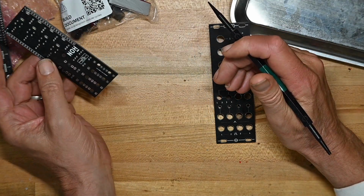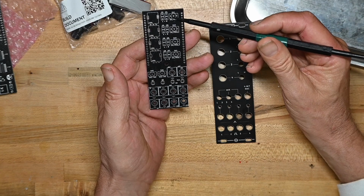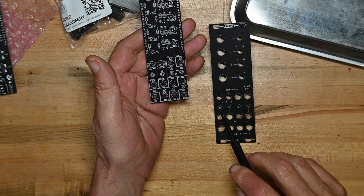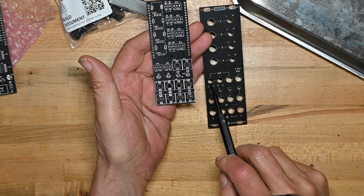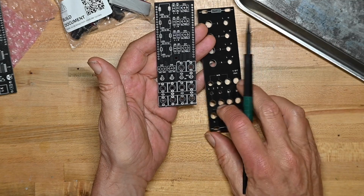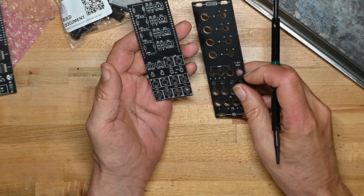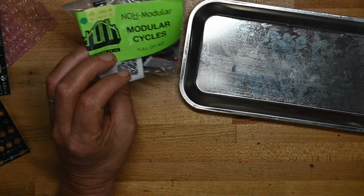And this is the logic board has been updated in January. This is from October 2022. Yeah, so this is switches, high and low frequency. Pots, 2 more switches, which are mix switches. I guess I'm gonna say that we're switching various things into this mix. I don't know if these are 3-position switches or 2-position switches. We'll figure that out in a couple of minutes. And they come out that jack, and these are all the individual LFO outs with LEDs above them. And yeah, it's interesting that there's a 4-bit DAC coming out of there. I probably will never use that, but it's good to have it on the board just because.